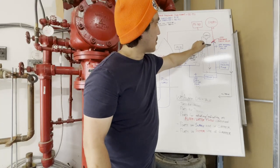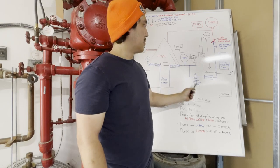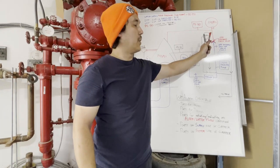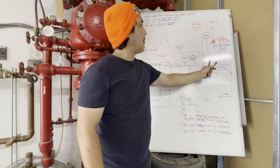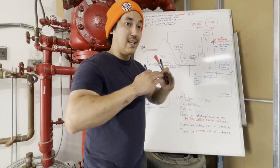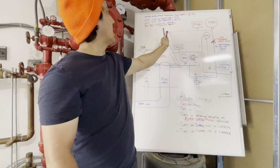It is a check valve — it locks pressure in one way. If I've got 70 PSI on my supply side, this will also be normally closed. We have a discharge check valve: we know how a check valve works — it locks pressure in downstream of it. So when we pump up the system, that pump is going to run, draw water from the supply side, suck water and push it downstream. We have a discharge check valve, and then downstream of that check valve we have a gauge, a low pressure switch, and then it just ties into the system port.